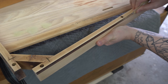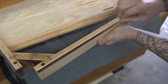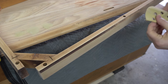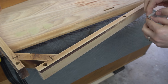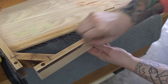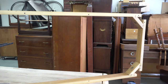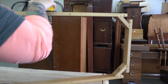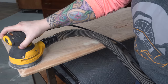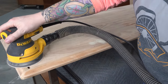I use the orbital on the flat areas of the base assembly, but I'm using just a piece of sandpaper wrapped around a thin paintbrush to get into this groove. It's really hard to sand these spots, so I find shaping it with a dowel or a pencil or something like that really helps get in there. Then I did a final hand sanding with 220 grit.